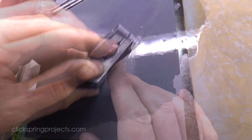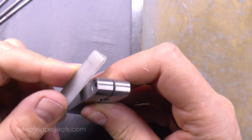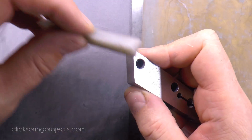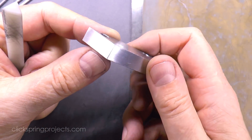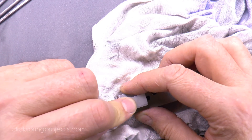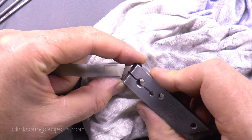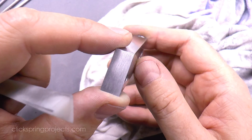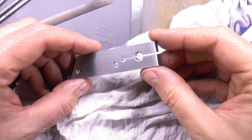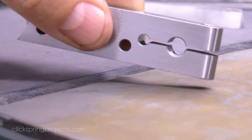As I mentioned before, I prefer the tool to blend in as much as possible with the surrounding machine. So with the part cleaned up, I've given it a decent brushed finish on the machined surfaces, and broken the sharp corners with an abrasive stone. But other than a light grain, I've mostly left the unmachined original surfaces as they are. The small pits and dents give the metal a bit of character, making it look like it's been around for a while, and this will help it catch up to the antique look of the rest of the machine.